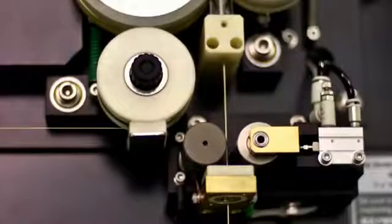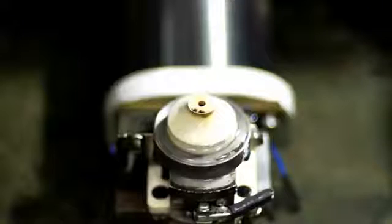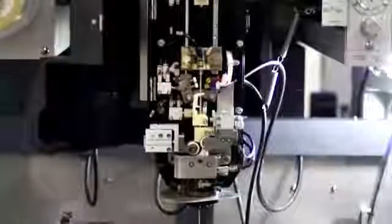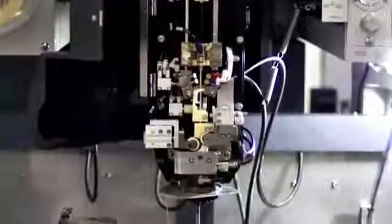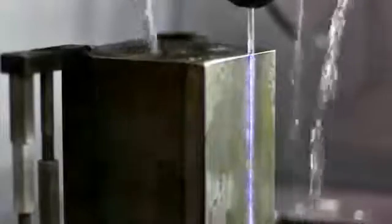A new auto threader design delivers improved threading capabilities. Upper rollers now travel with the Z-axis, creating a constant distance to the upper guide. This allows for nearly 14 inches of annealed wire length, reducing the wire curl ratio to 10% or less, improving threading reliability on tall parts. The insertion method can be set to match the workpiece shape, and operators can now thread without the jet stream on to get closer to the workpiece or machine smaller parts.